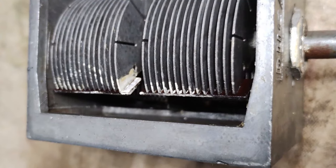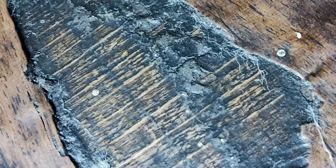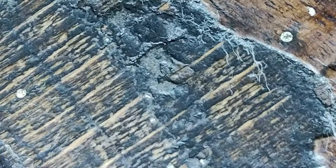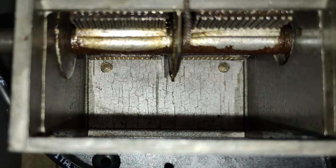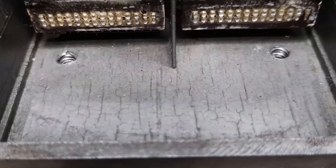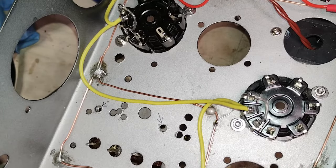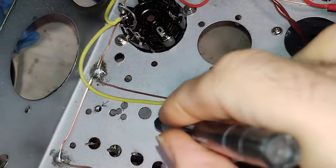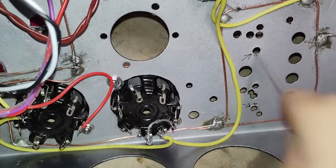After drying and relubricating the component, some wall paint splashes emerged. Clearly, the radio was exposed to paint splashes that also reached other areas outside and inside the cabinet. The variable capacitor armature is made of a cast alloy that now shows stress. Unfortunately, eventually it will crumble. The variable capacitor was installed adapting the chassis, although more adaptation has been necessary during the restoration.